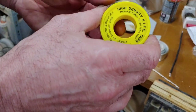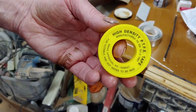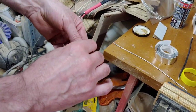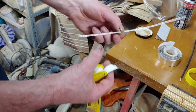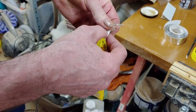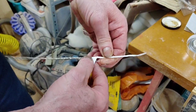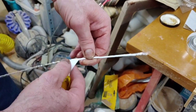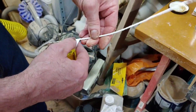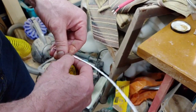The conductor has been left for 20 minutes to dry. We're now using high-density PTFE tape - it's a lot thicker than your standard stuff. We're going to give this three layers. You can put the wire in a drill and have someone hold it at one end while you feed the PTFE tape, but because this is only a small length I'm going to do it myself.